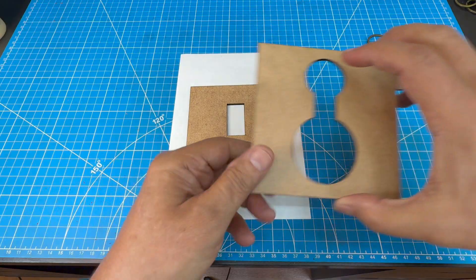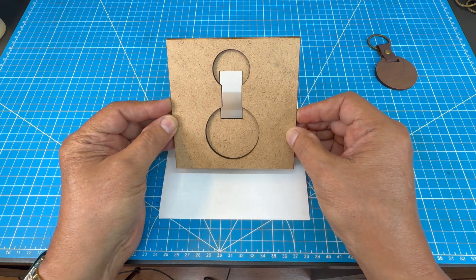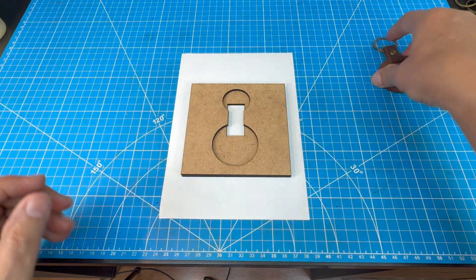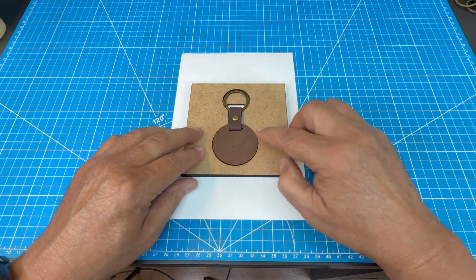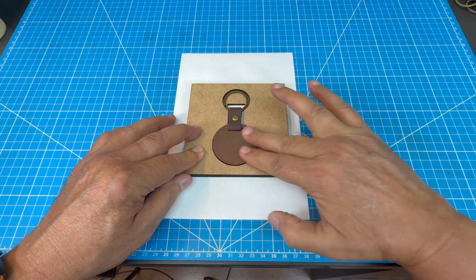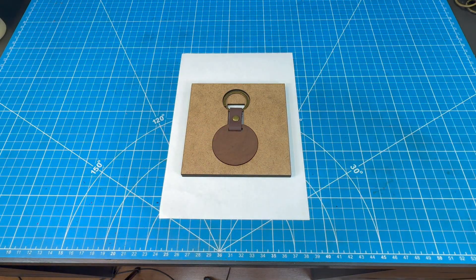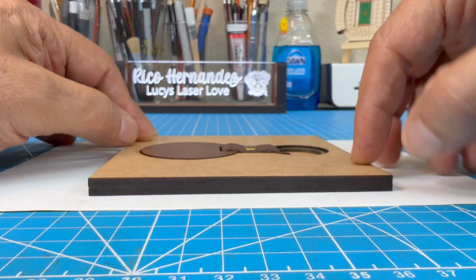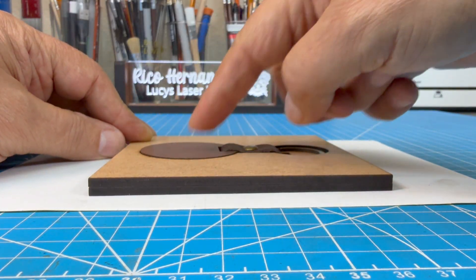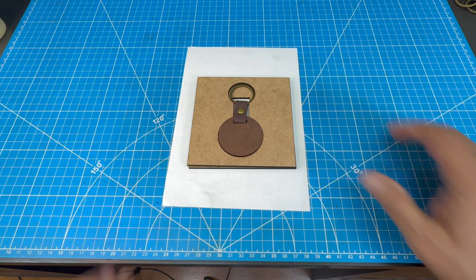Let's see how these two jigs fit together. I'll place the top layer on top of the bottom layer and when I square them together the two shapes align perfectly, just like they did in LightBurn. Now let's place the blank in there — wow, makes a huge difference. This piece is now lying flat and flush, the band is lower, and I have no fear of it hitting the autofocus pin. Looking at the cross section, it's totally flat and flush. Let's go back to LightBurn and finish designing the jig.